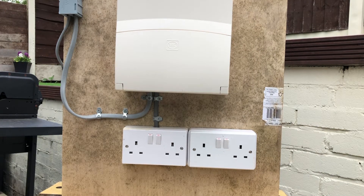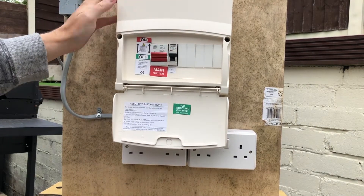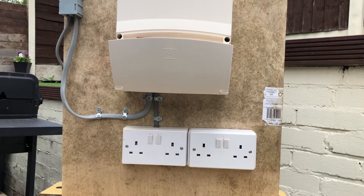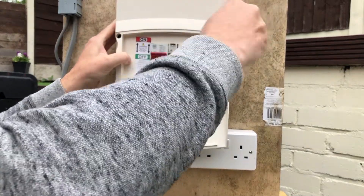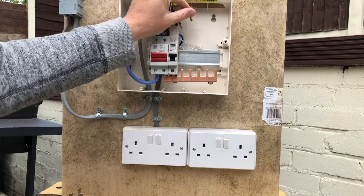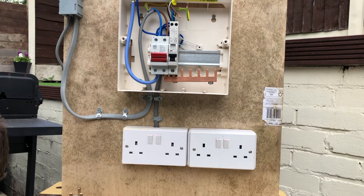So let's make a start. You can see we've got a standard setup — an old-fashioned plastic board with a main switch, and we're using an RCBO. It's not connected to any mains, it's just for pure testing purposes. I've got a couple of sockets here and a radial circuit. I'll take the cover off and make a start. One of the simplest things you can do is get all your stuff prepped and ready before you start — it's important to have everything handy. The earth CPC and live/line conductors are already out and ready to go, just to speed things up. The idea of the R1/R2 test is to test at every single point, as BS7671 indicates.